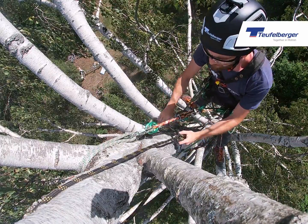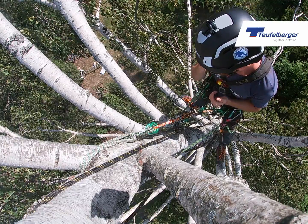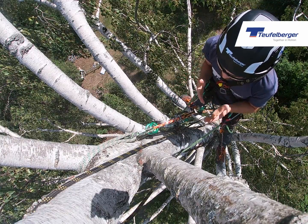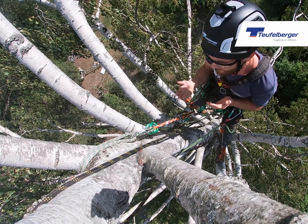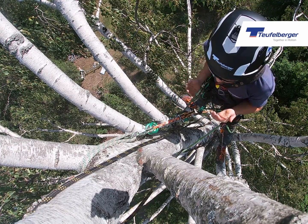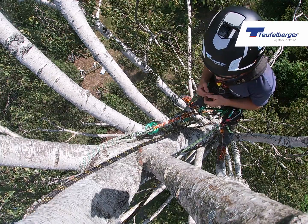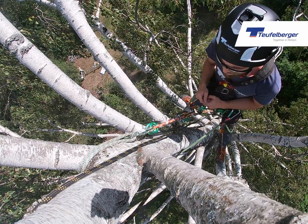There's a whole lot of different ways you could configure this, but one quite nice feature is that you can implement some form of backup if there's any concern about one of your anchors failing, that it's backed up to the access line. At least there's some form of redundancy there, which would obviously need to be risk assessed properly.